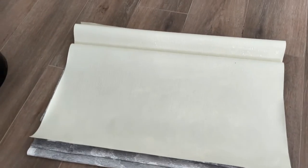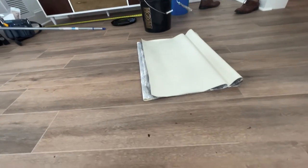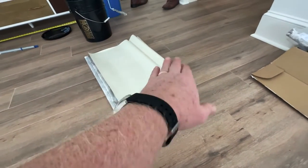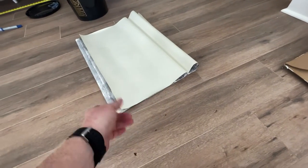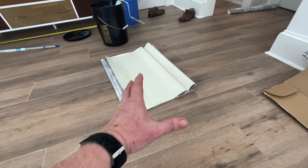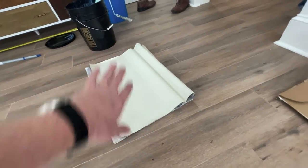I don't know what to call this method of folding wall covering, except that it resembles the candy my mother used to buy when we were kids during Christmas. You ever see that candy that sort of goes like that? So you flap it back and forth in sections of at least 15 inches, 15 to 20, so that as you open it up on the wall, you have sections that go immediately onto the ceiling.